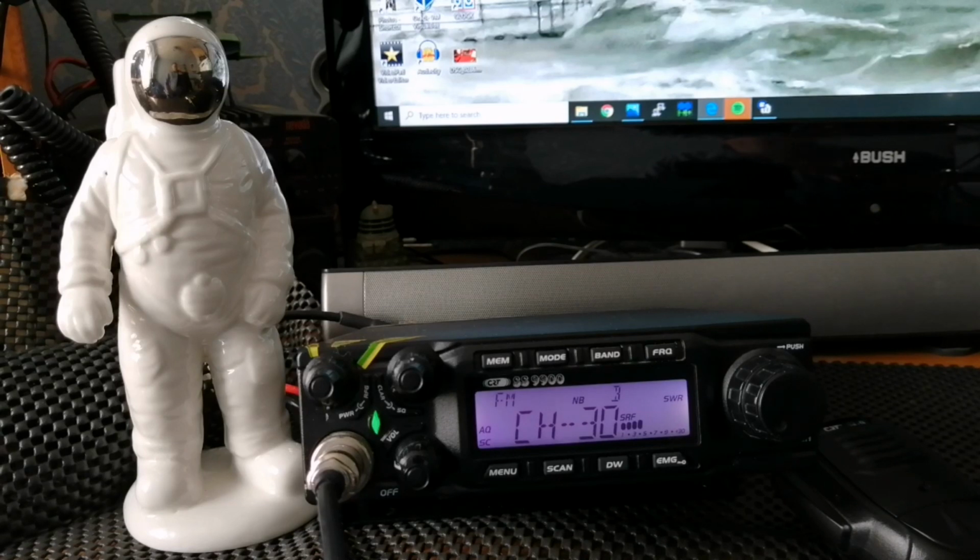The standard radio covers 28 and 29 megahertz. Absolutely fantastic for the amateur radio person who's using 10 meters, sideband and FM, and also AM available as well. Lovely little radio, good audio. But once it's been extended, the version 3, which I have in front of me, goes from around 25.6 megahertz, no gaps, up to 30 megs. There is a VFO, so you can tune this in very small increments all the way between those frequencies.